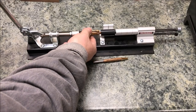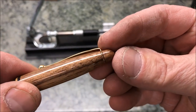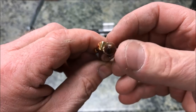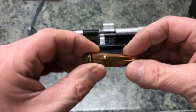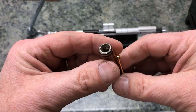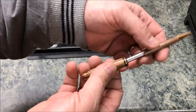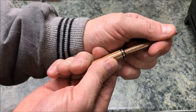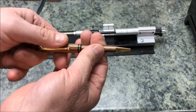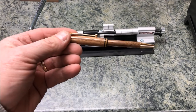I've given the CA glue plenty of time to dry on my finial — it should be in good shape now. Take a quick peek: it's got a nice fit. If you look at the cap of the pin straight down on it, you'll notice that you don't see a lot of the gold from the clip, where on the other one you did. Leaving that finial thicker made all the difference in the world. There's what the inside of the pin looks like. Let's go ahead and put this thing together — slide it right up, and watch how much further it goes in. Made for a really nice-looking pin. I'm very happy with that.